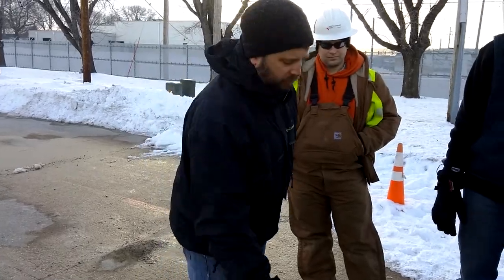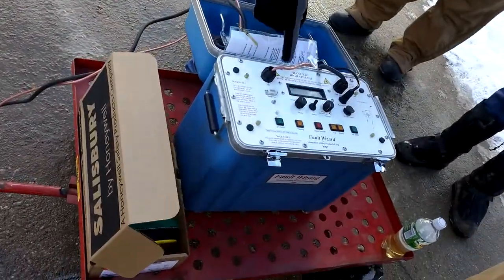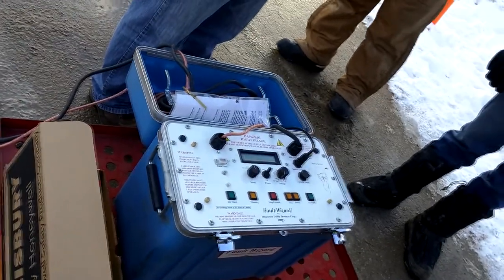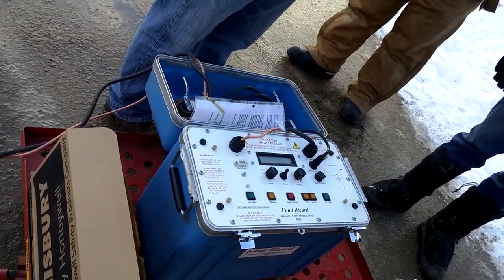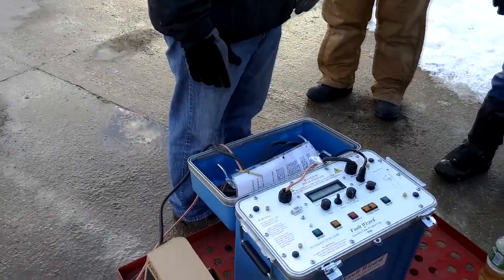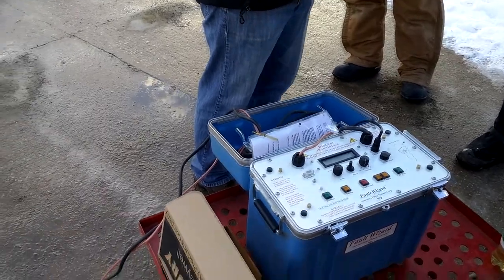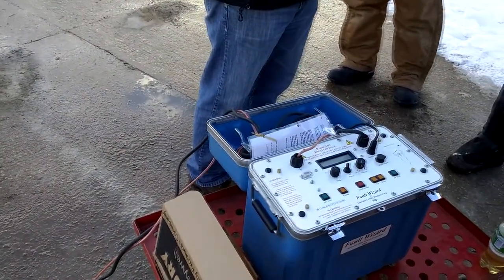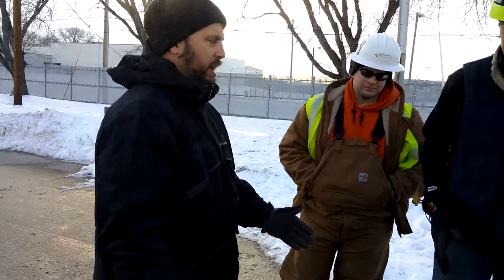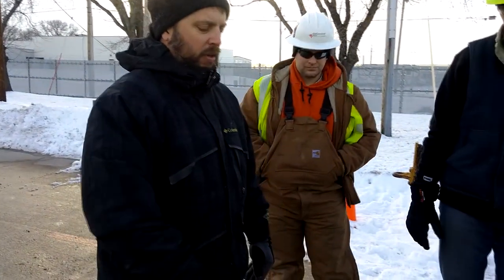There are some other features up here like an external battery hookup and a data port. The unit actually stores the waveform inside and you can view it with software. If you've ever seen a big thumper truck, they have to move a cursor to where the wave is happening — where it shorts out — to the leading edge of that. But you don't have to do that with this one. You just hit thump and it interprets it for you and gives you straight footage to the fault. Then you go to cycle thump and go listen for it at that footage.